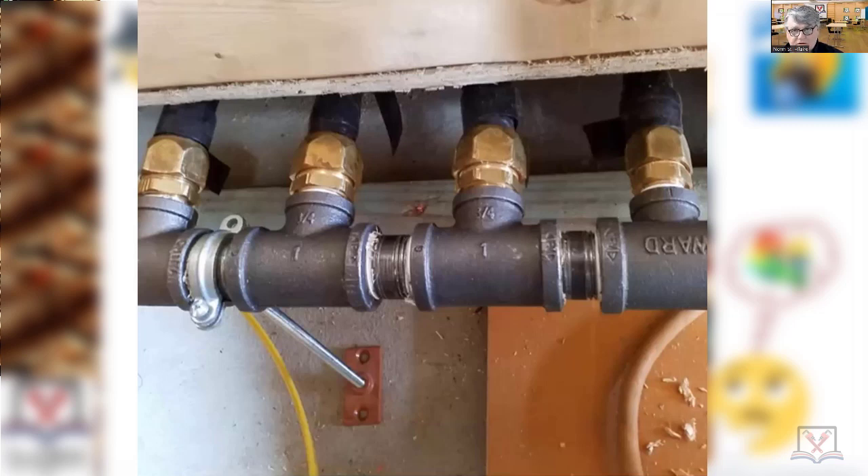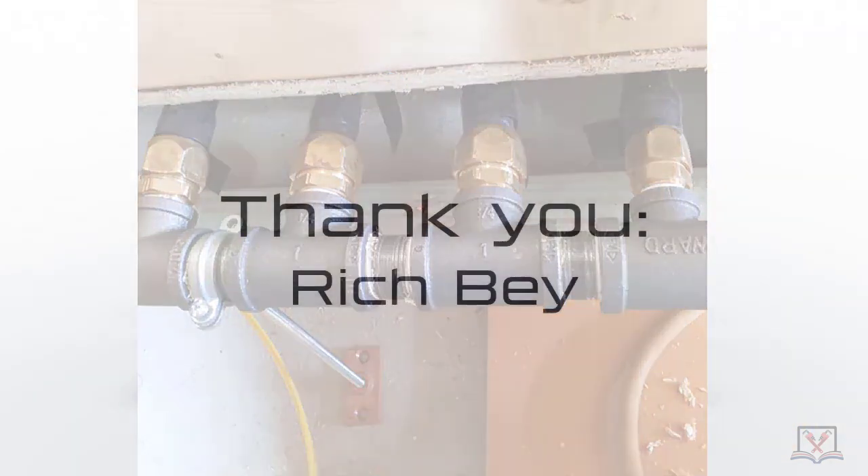The next picture is the return inspection — the hanger is still missing a screw and not even anchored into the floor. This was the inspection that cost this guy money and got a complaint filed against him. He taped it with electrical tape, not the approved jacketing material provided by the manufacturer. And by the way, he wasn't certified.